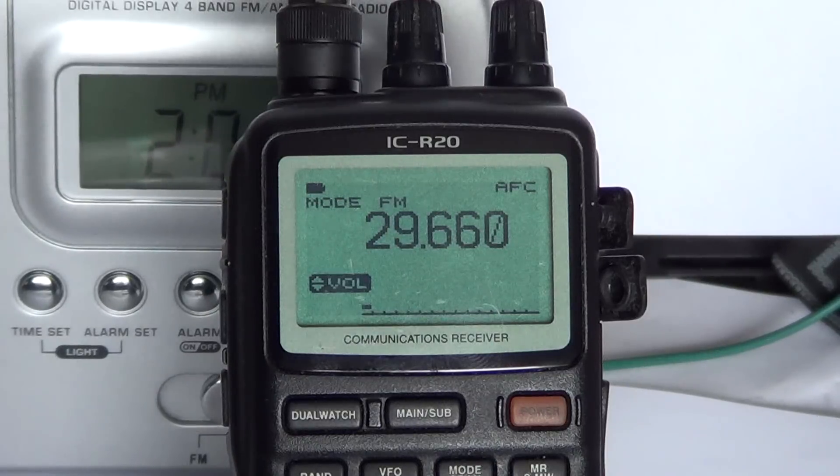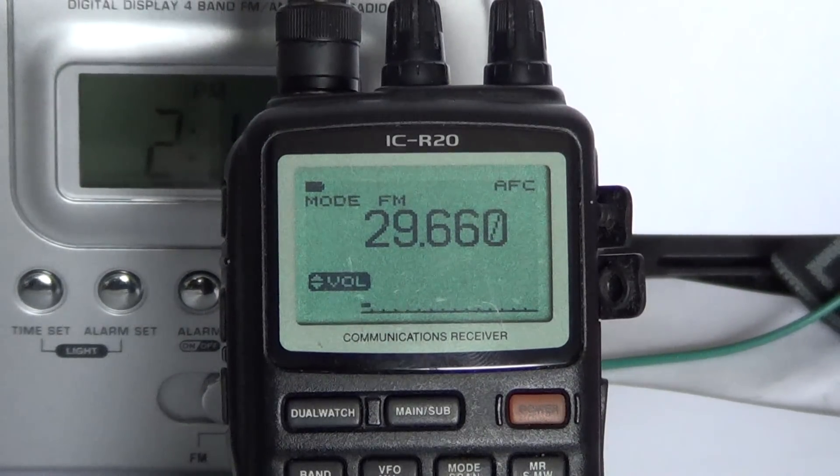If you go on Google and type 'UHF VHF channel spacing' or 'tuning steps,' you'll come across frequency lists with the different spacings available. Having the right frequency step is important because when you scan with the radio, you'll always be on the correct frequency when it stops. If you use an awkward spacing, you'll actually be off frequency a lot of the time. You'll learn this as you use the radio, but searching 'channel spacing VHF UHF' will give you lists of frequencies and the natural spacing you should use.